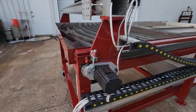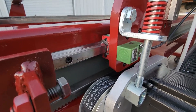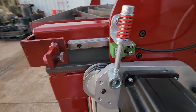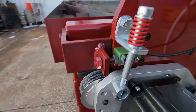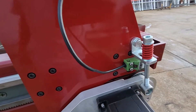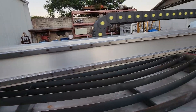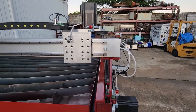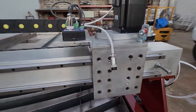I have all my reduction drives. I have these proximity sensor switches — I used them on my little Grizzly hobby mill and I like them, they're waterproof — so I put them on this table. As you can see there will be some adjustment there for when my gantry is getting squared up, and I have another one on this side as well, fully adjustable. I also have another proximity switch here for homing.